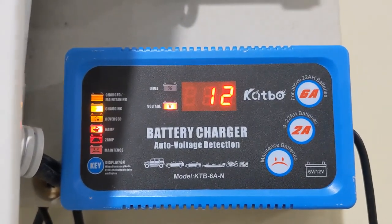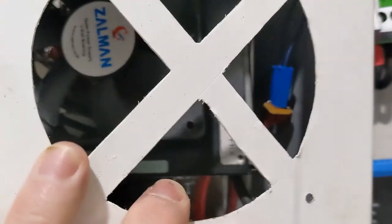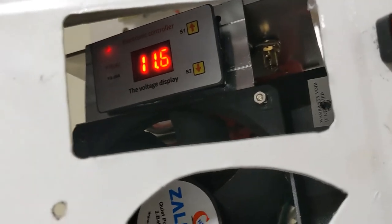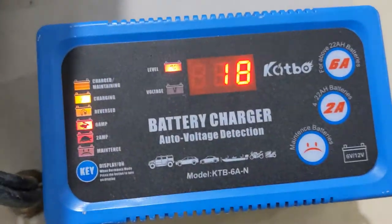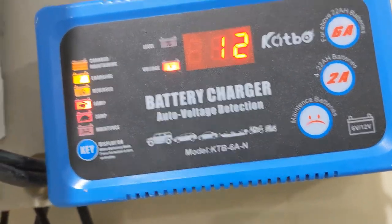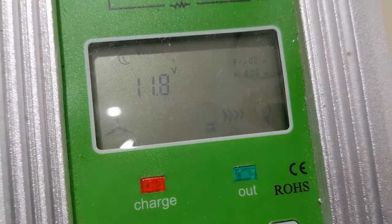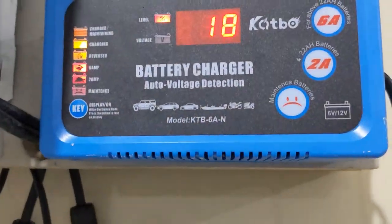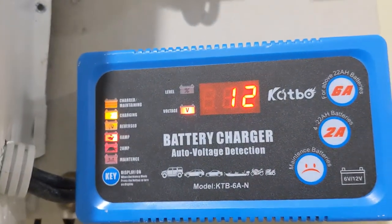After our first night of charging, we're at low voltage — 11.6 volts. From the AGM batteries chart, that should put us at about 20% state of charge. We're showing 18% after full discharge, so we're in the ballpark. On the MPPT controller we can also see it's showing low charge on the battery. Everything seems to have worked very nicely.